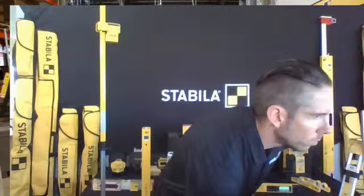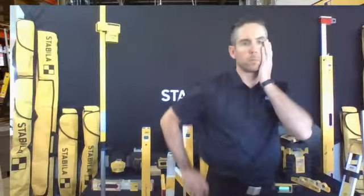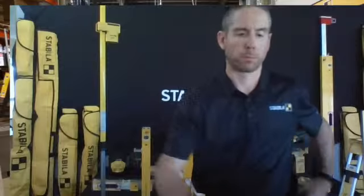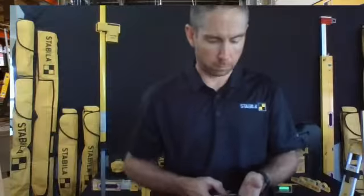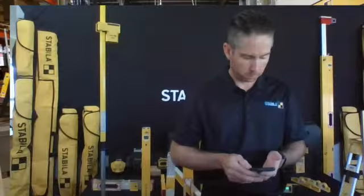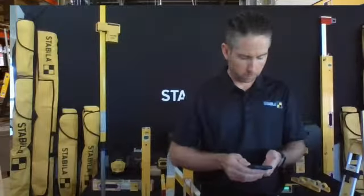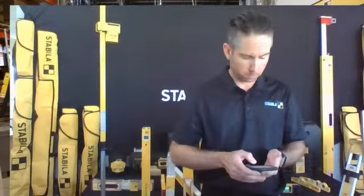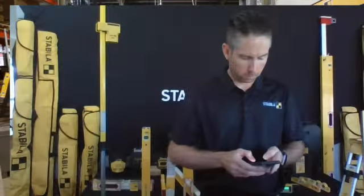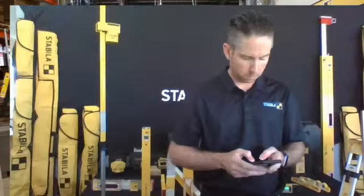It has a little plunger on the backside, so you put it in there and pull it out. After I lock this in the door, I'll set it on the frame. Now this level is perfectly straight in line. So the door is open, but before we get started, there are a couple of things. This is going to let us know where the top corner of the frame is, to be in or out. Do we have drywall where the mud is built up on the outside corners? Because of the way they hung the drywall, you might see some buildup of mud in those corners.